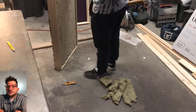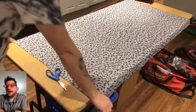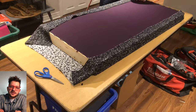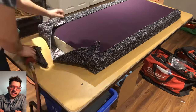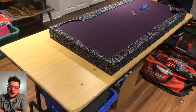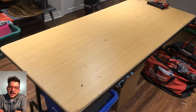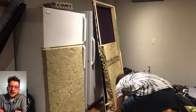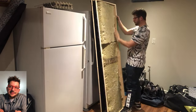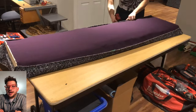You can see I'm putting the rock wool safe and sound three-inch insulation inside the frames, and I go around the frame and shoot a few 16-gauge nails into all sides just to hold that insulation in place so it doesn't sag over time into the fabric, which would give lumps in the panels and overhead clouds. Here at Sound Headquarters we pay very close attention to detail — that's our calling card. We do really nice finishing work and all custom work for our clients, because we want them to be very satisfied with their room and studio.